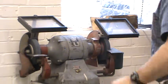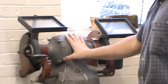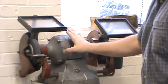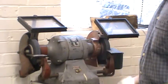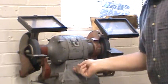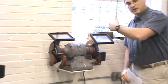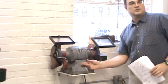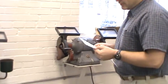When you're grinding, you don't want to stand in line with the grinding wheel as it starts up. One reason a wheel exploded one time was that it was near a stock rack and somebody bumped the wheel with the stock and put a crack in it. When you start it up, stand to one side. If those wheels do explode, they're going to explode in the plane the wheel is in. If it doesn't blow up in the first ten seconds, it's not going to blow up — then you can step in front of it.